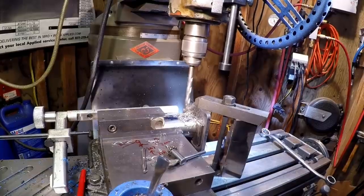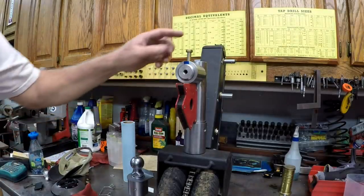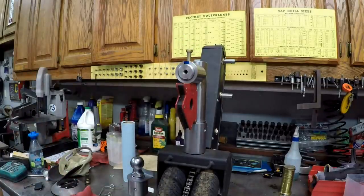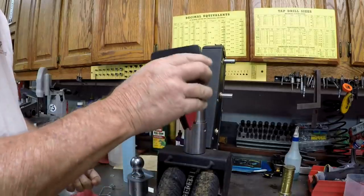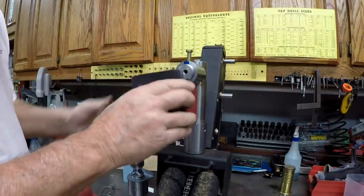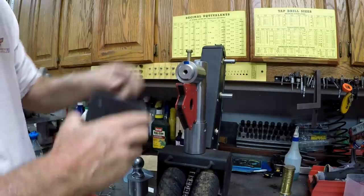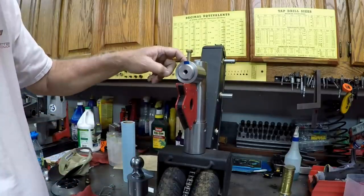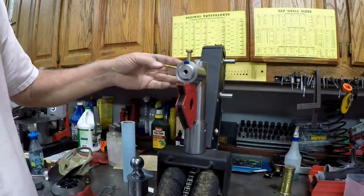Success. Well, that worked out good. So the plate, which will bolt on for tightening, I can clock it, get it parallel and perpendicular, and then go ahead and weld it. Weld it here. I've got a weld prep there. So ready to go ahead and weld this back together.